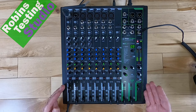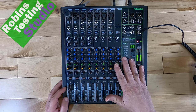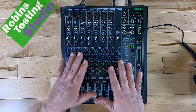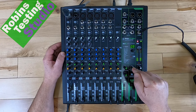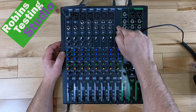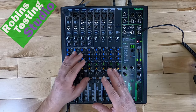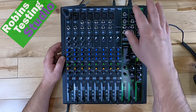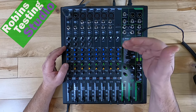Here we are — this is the Mackie Pro FX 12 V3, a 12-channel mixer with an incredible audio interface built into it. That happens to be a 24-bit, 192 kHz processor running the audio interface out of this unit. Two channels to our computer, four channels back into here. It has channels 1 and 2 set up into the blend, and channels 3 and 4 dedicated on lines 11 and 12. You can run this as two completely separate systems — as an audio interface for a live stream to your computer, or to record with it, while using the main controls to run the room separately at a different volume level, which is a big important thing with a mixer and audio interface built into it.